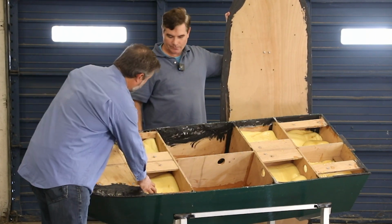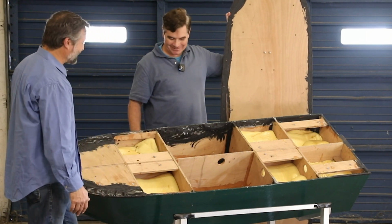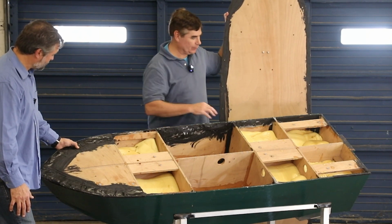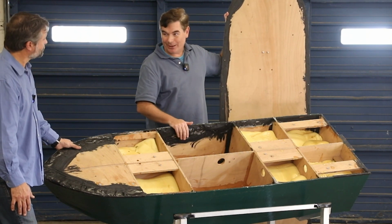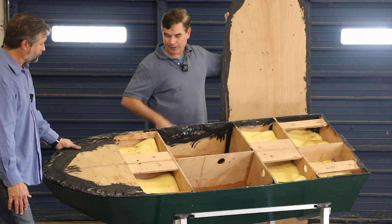Yep. And with the space that remains, making it unable to sink is probably not a bad idea. And I think a lot of teams have found this kind of structure, where you have a large motor on the back and move the batteries a little past midpoint, is the right way to balance out that weight to make sure you're getting as close to on plane as possible.